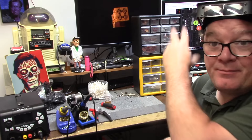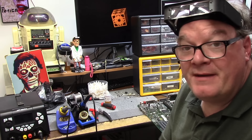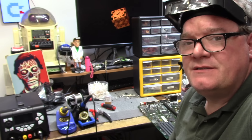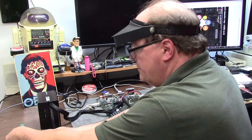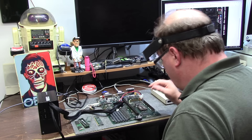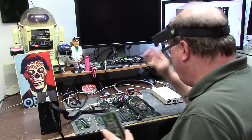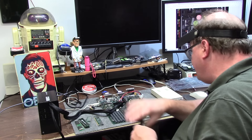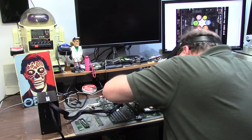We're gonna clean up this mess and the trash and wipe everything down, make sure we don't have any metal bits anywhere, and we'll go for a final test — full ATK spectrum of analysis and science and math. All right, we're getting geared up here — got the RAM. We're gonna do just chip RAM first and then we'll put in this assortment of others. Using my 030, it is jumpered for internal, internal. And I'm gonna move DF0 to external so this GoTek will boot significantly faster and I don't have to wait for all the hard drive stuff. This is just the base 030, 25 MHz. Let's see what happens.